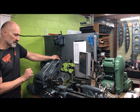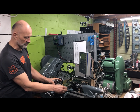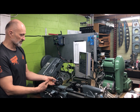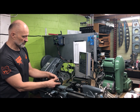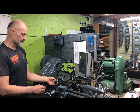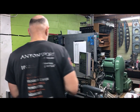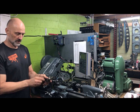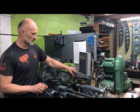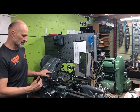It's really just about the machining of these POM pieces and how to use the ELS to your advantage. I think that turned out okay, I'm satisfied with the results - it was especially useful for threading and for the taper turning. I also have some improvements in mind: I have taken off the use of the compound, so this is just a sturdy mount. But I had still to swap tools and also swap tool holders. So one improvement would be to stick with one tool to minimize the change of tooling and set-up time. And also how to read the drawings in preparation for the job.